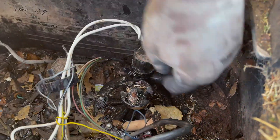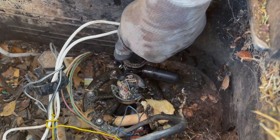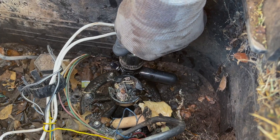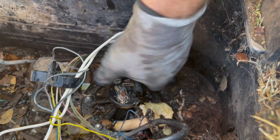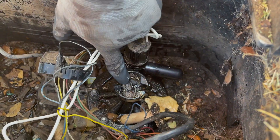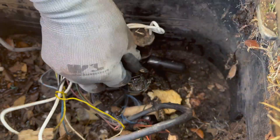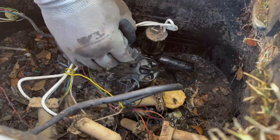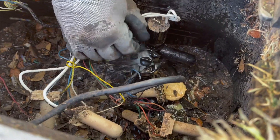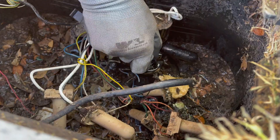So now you can still open up your valve manually with the solenoid. I don't know if you can hear it opening up. Or these have a relief screw right here on top of that flow control — you can also turn it on that way. That water release is normal when you use that relief screw to turn it on. Don't unscrew that very much or that whole thing will come out of there.